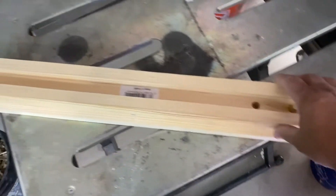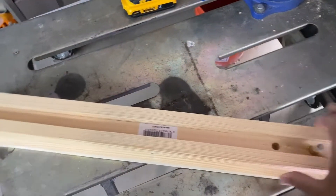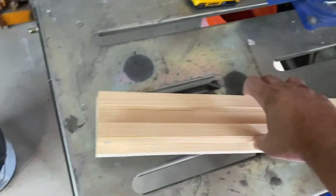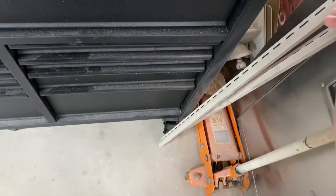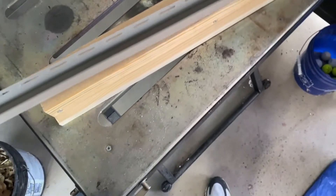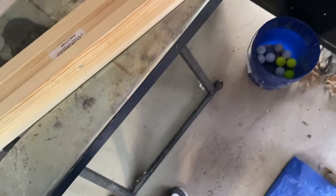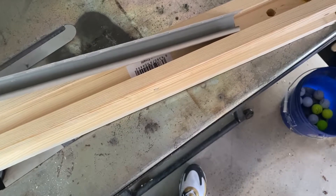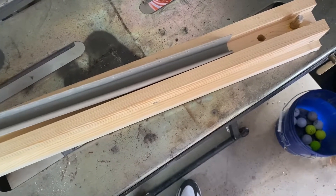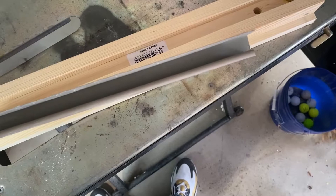Here's my jig — it's just a 24-inch little one-by-three on the bottom. I took one-by-twos on each side; I cut one of them wrong but just used it for the edge, and cut it to fit the width of this piece of vinyl J-channel so it fits right inside just like that. My first hole on the J-channel will be using a 15/32-inch drill bit — that's perfect for the bulbs to snap in — and my first hole will be an inch and a quarter in from the end.